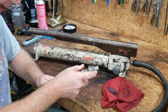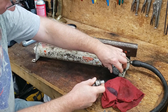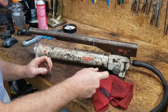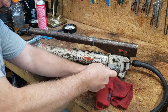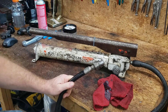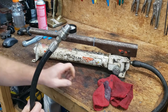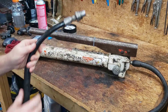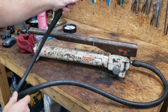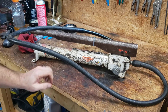After a little fiddling, I may have been able to get the prime back on this pump — it may have just lost its prime. I've got it turned all the way clockwise, I'm holding that valve, and you can see fluid coming out of there. So I'm going to give it a few pumps — you see that fluid coming out? I think this pump may be good, folks. We may not have to rebuild it after all. I think it just lost its prime — unlike me, I'm still in mine.